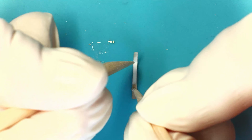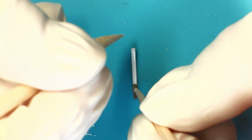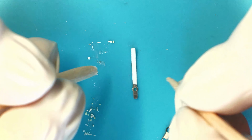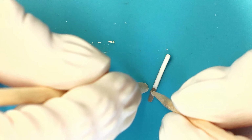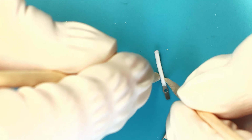There's the basics of the build, but obviously I made mistakes, things went wrong. Let me take you through a summarized timeline of the build rather than doing a full build log. So I started by re-luming the hands, and the first mistake I made was applying too much pressure with the pegwood when scratching the original lume off the minute hand. And just like that, you've bent the hand and made it completely useless.